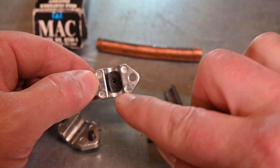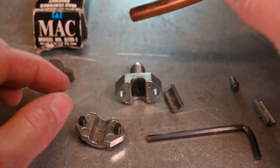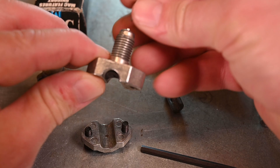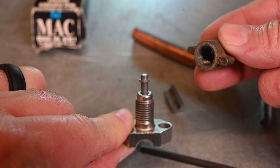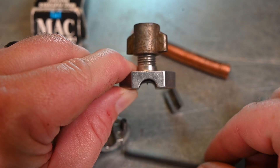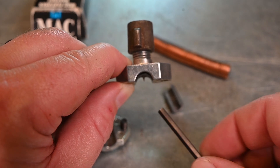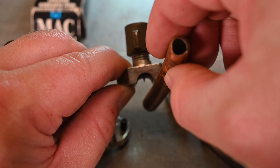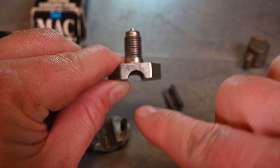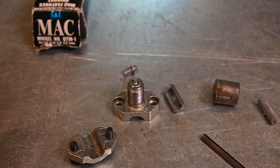The part that goes around the copper is right here, and as we have smaller and smaller sizes, we have these little adapters. So if we're going to use quarter-inch copper, I would use the thickest adapter, which fits right inside my bottom piece and takes up less space. For five-sixteenths, I would use the smaller adapter. What's cool about this is it has this little piece of rubber right here. We're going to clamp this around our copper, but we have to somehow puncture it to make a connection. Once clamped down, we put this little adapter piece right here into the end. Then we have the cap, which is built just right to connect. As we start threading it down, you'll see this little needle coming out. If we continue to spin this, you can really see that needle - it's punctured all the way through inside the copper. Then we back this off, and notice that needle disappears. It punctured the copper, then we take the little adapter out of the cap and gauge it up to this port, and we're ready to start recovering refrigerant.